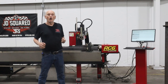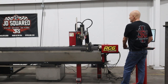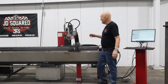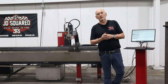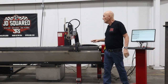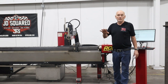That brings us to the RC6 — what we call a cantilever machine, because it uses a cantilever to hold the torch. You can see the cantilever going in and out, and the machine goes up or down with the automatic lifter. The reason I like cantilever machines is that a lot of customers are doing things like 10- or 12-inch channel, laying it flat and cutting holes — basically making stairs, which is a huge industry. With this machine it's very easy to bring a forklift, load from the side, drop it in and go, no matter where the head is. That's a major plus.